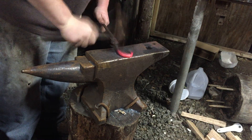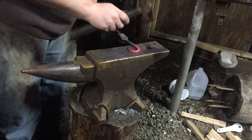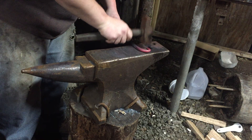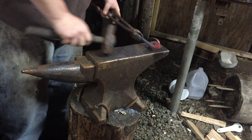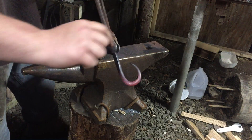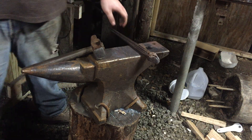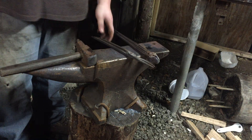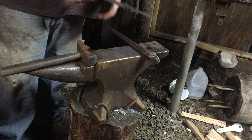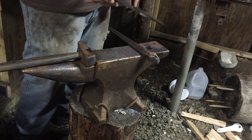You can see I bent a little bit on the horn. You can bend steel if you don't have a horn, but it could be a little more difficult to get a clean bend — you're probably going to have to radius your flat block pretty heavily. So this is what it's looking like now. Then I'll take my scrolling tongs — yes, I use scrolling tongs — and do the little scroll. It's just simpler for me. Some people call it cheating, but it's one of the tools I made a few years ago. It makes it a lot easier to do the little scroll at the end.